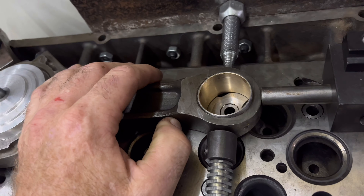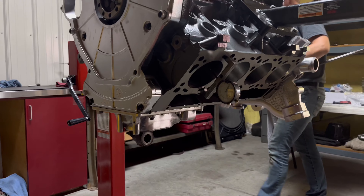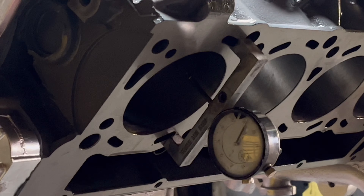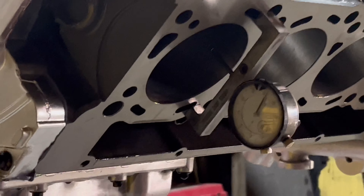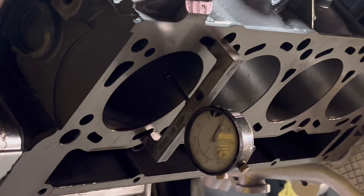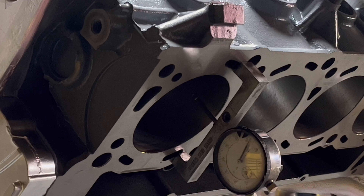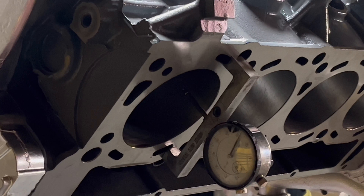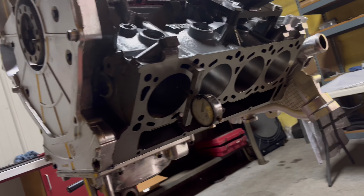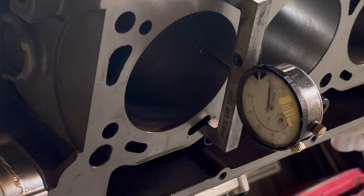Let's finish this bushing right in the engine — that's what we've been working on all this time. It works great... well, it did not work. So let's remember this: the far side over there is now 25 thousandths and the closest side to us is 34 thousandths — 25 and 34. That sucks. I think we need to surface a little bit off the head. Nine thousandths off — that sucks. Remember: 25 on the right, 34 on the left.